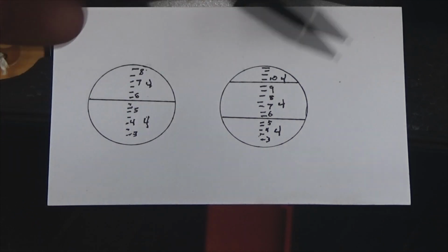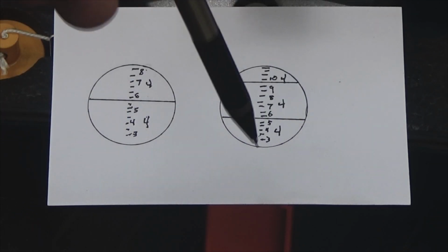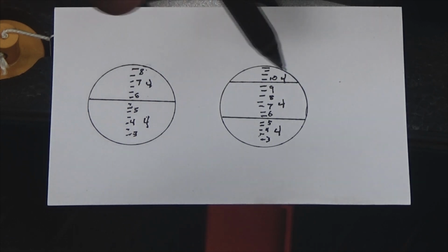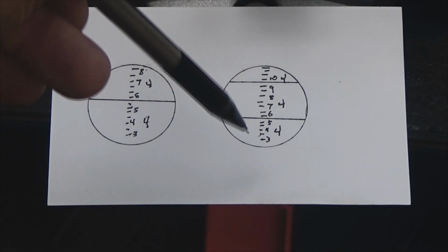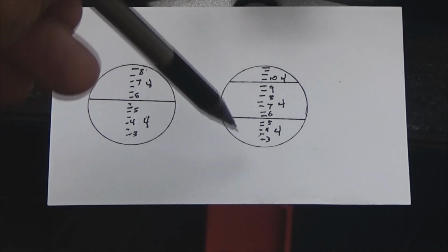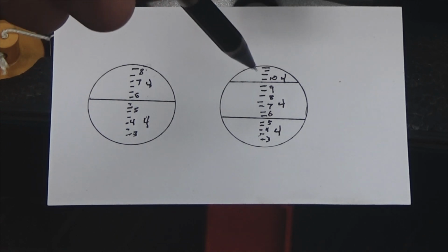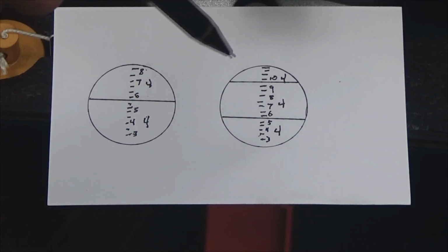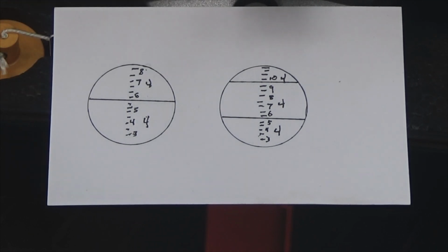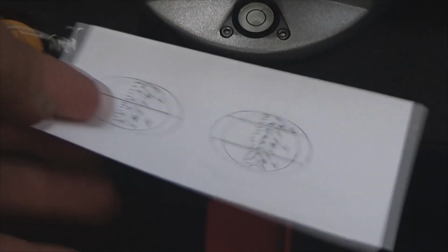There are 2 other lines at the top and at the bottom, and for clarity, I didn't draw it on one piece. But these lines will give you an altitude, in this case just above 5, and right here just below 10. You would do some fancy math, and you could get the distance very accurately. But again, I can't show you that on the transit itself.